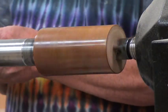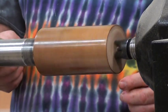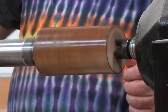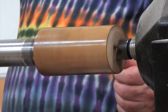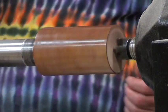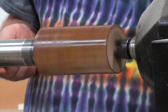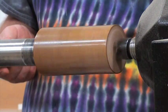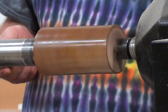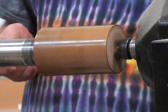I'm going to crank that back up. In about 30 seconds to a minute at home, I can do about 1,000 RPM — I'll turn it up to 1,000. Let it sit 30 seconds to a minute, do one more layer. I'll do three of these and then I'll buff it out. Are you going for high gloss? Yes — if I want anything else, I'm using easy stuff.